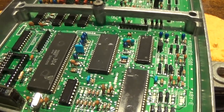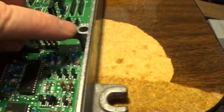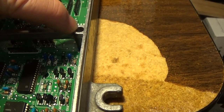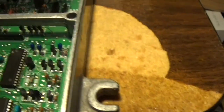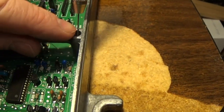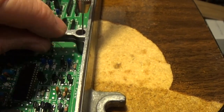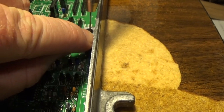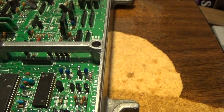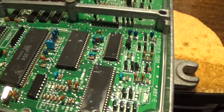You should really try to touch both components with the base — here's a good example: say there's a hole here, you touch the soldering iron here, and let's say this is your component coming up — you want the soldering iron to touch the base and the component, heating up both, and then you touch the solder to the base and it wicks into everything. The rosin from the solder helps it flow.